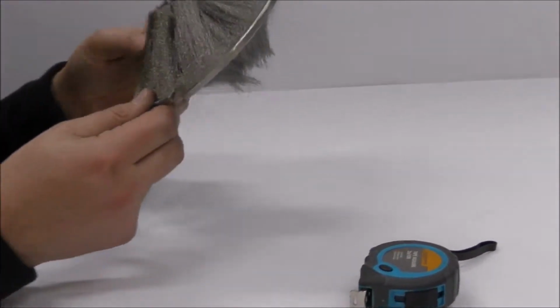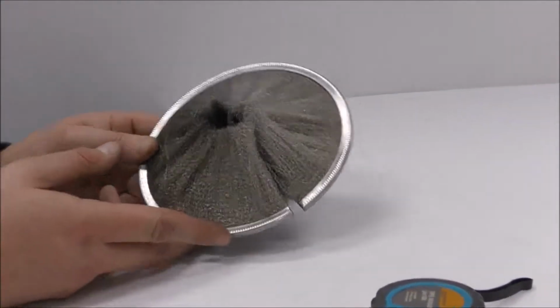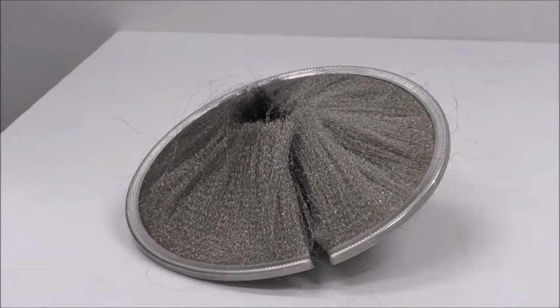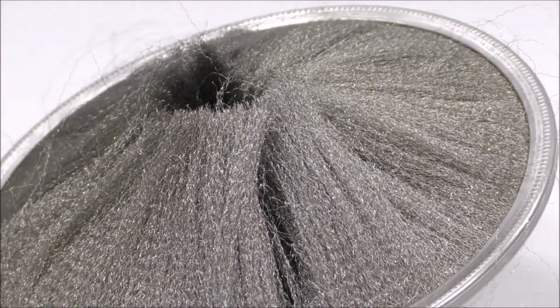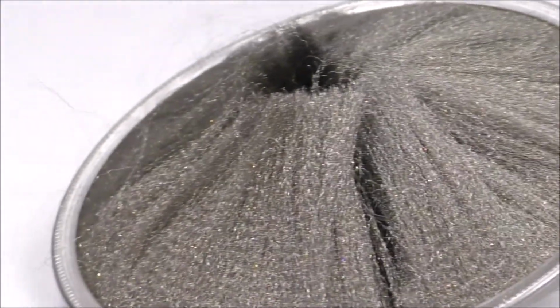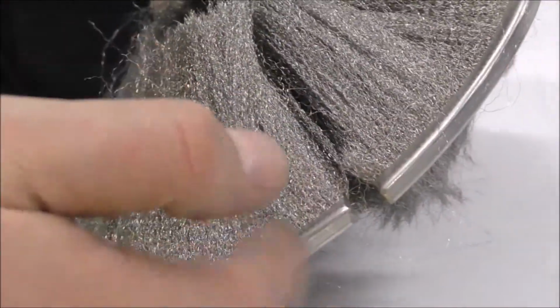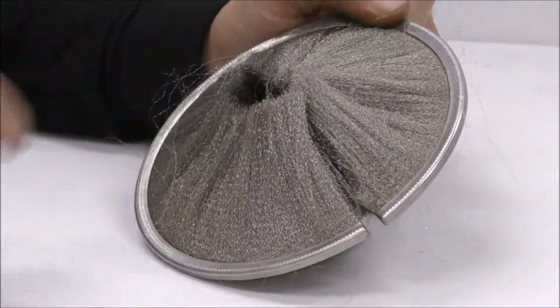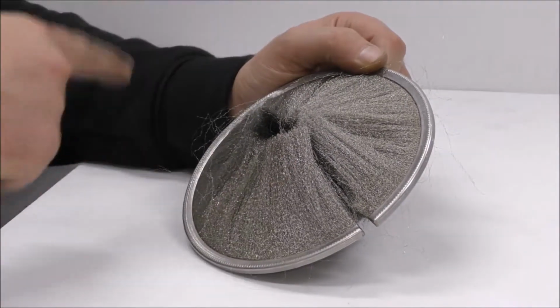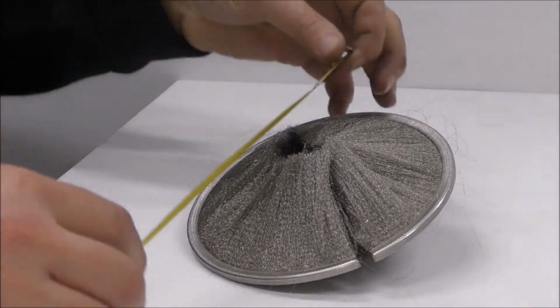So this, to me, looks like stainless. Depending whether you're going to replicate an existing brush or design your own, you will need to stipulate whether it's either galvanised, being the standard, or stainless, if preferred. In this case we're going to call it a 5mm width stainless steel strip brush, which is wound, so inside bristles, inside disc brush wound to a coil, one single coil in a diameter.